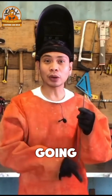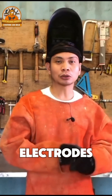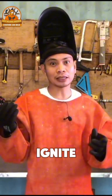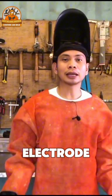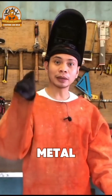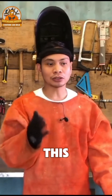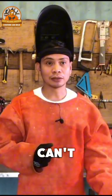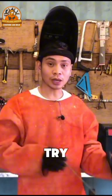There is a thinner one for the metal we are going to weld, because when setting the amperes we depend on our electrodes. If you can't ignite it, you won't be able to weld. What we need to look for is an electrode that is thinner than the metal we are going to weld. If we can't find one like this 1.5, at least use a 2.0 welding rod.